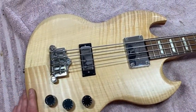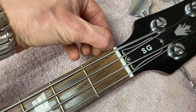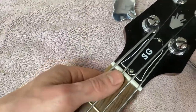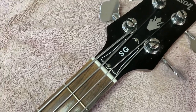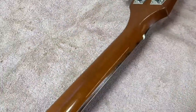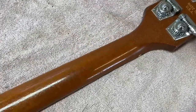So here's the bass - a Gibson SG Supreme bass with a nice satin nitrocellulose finish on it. What we're doing today is slimming down the width of the neck here at the nut, then tapering that down so it joins the original taper somewhere around the 12th fret. This is a 41mm nut, and the customer likes a 38mm or even a bit below - like a jazz bass - whereas at the moment it's kind of in between a P bass and a jazz bass. First we'll sort the width, then change the profile, and afterwards we'll sort the finish and blend it into the old finish.